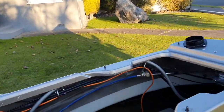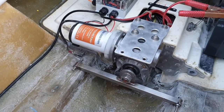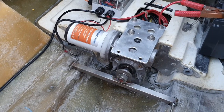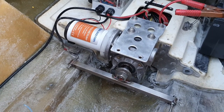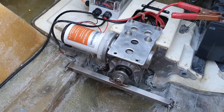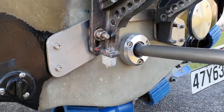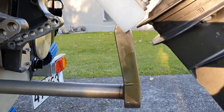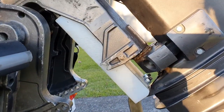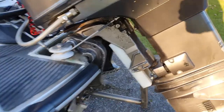There are quite a few key elements to this. It's running a DC motor onto a 10-to-1 reduction gearbox which drives a 20mm stainless thread, basically attached to a shaft. Out the back here, which is all sealed off and comes through the hull itself onto the lifting leg, and then you've got the grooved-out nylon block which runs on the motor.